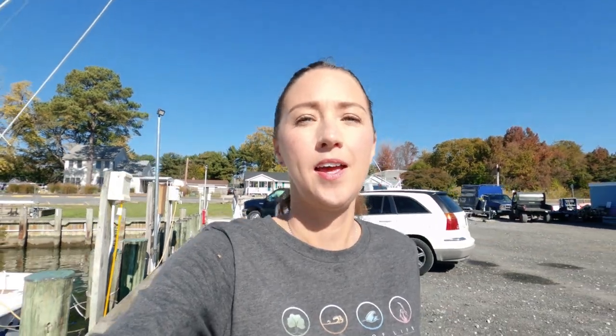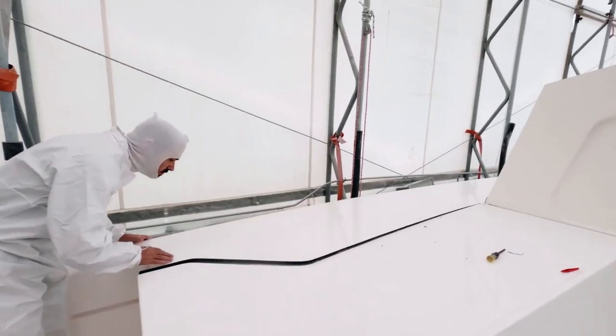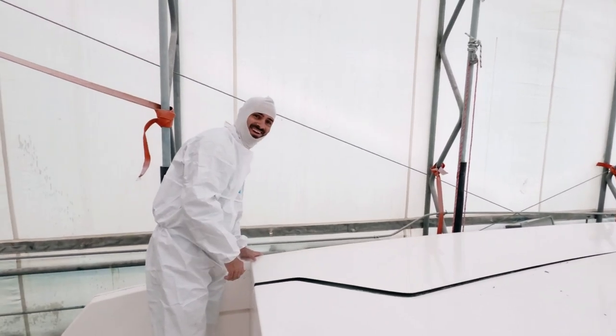The sun is out today, we've got a beautiful fall color change happening in all the trees around here, and the temperatures have warmed up enough that we can finally go ahead and bond those side decks we've been working on for maybe a little over a week now. I've got everything taped up, Matt has taken the acetone to clean it, and we're going to do one at a time because we may still need heating lamps to make sure everything cures. Today we'll do port side and then prep for starboard and do that tomorrow. How fun is that — we're going to have decks we can walk on!